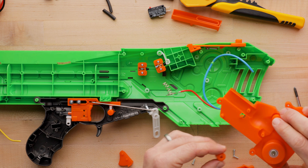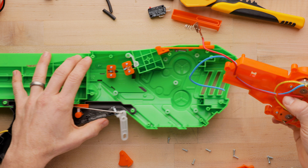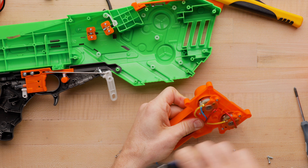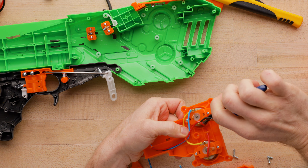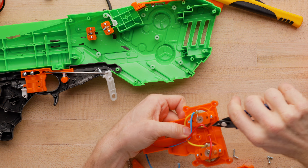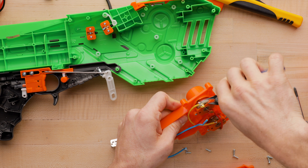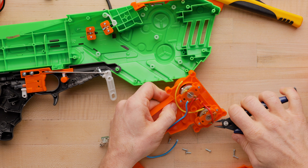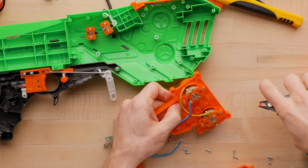Stuff's just dropping out. The worst part about modding for the first time is remembering where those bits go. As usual, we're going to snip everything off. These capacitors could stay — I can see they've done the same melted plastic technique. The capacitors actually could stay if you wanted to keep them; they're there to keep down RF or radio frequency noise interference from other devices, and that's a compliance thing in most countries.